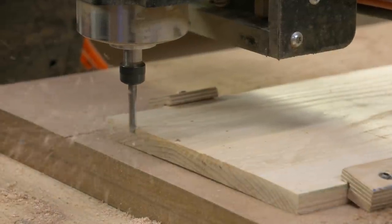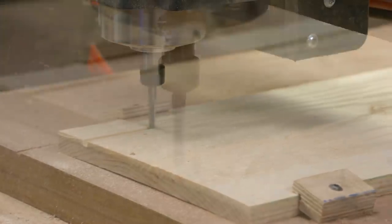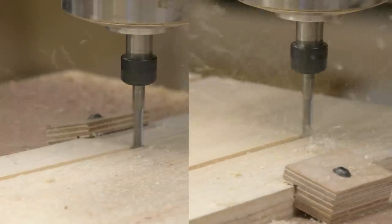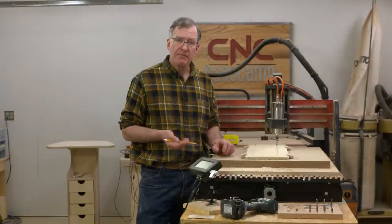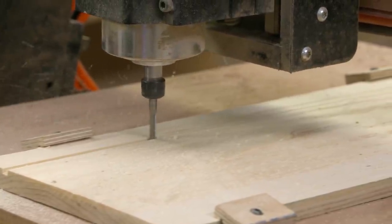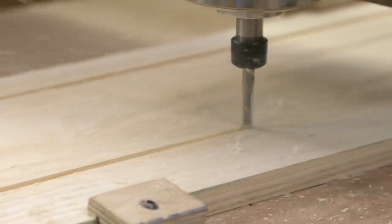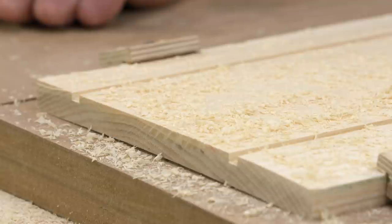Let's go to our CNC machine and do a couple sample cuts. The first one I'm going to cut very slowly at a fairly high RPM. The second one I'll cut at a lower RPM and pretty fast. Hopefully we'll see the difference: a cut that produces dust and probably runs hot, versus a cut that produces chips and cuts cool. Cut number one: the router was going very slow, RPM was high, it produced a lot of fine dust — that means heat buildup on the router bit, which shortens its life. Cut number two: running with a high feed rate and low RPM, we've got these nice coarse chips, and that is what we want because it means the bit is running cool.